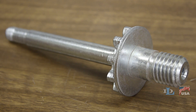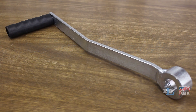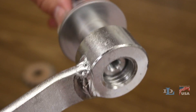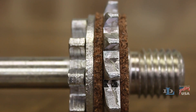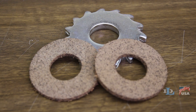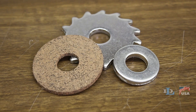The components of the brake include the drive shaft assembly, with a large washer affixed to it to create pressure on other parts, and the crank handle with a large threaded hub, which engages a thread on the end of the shaft. Between the shaft washer and the handle hub are three free-floating parts: a ratchet wheel and two brake pads on B Series winches, or a ratchet wheel, brake pad, and pressure washer on DL B Series winches.